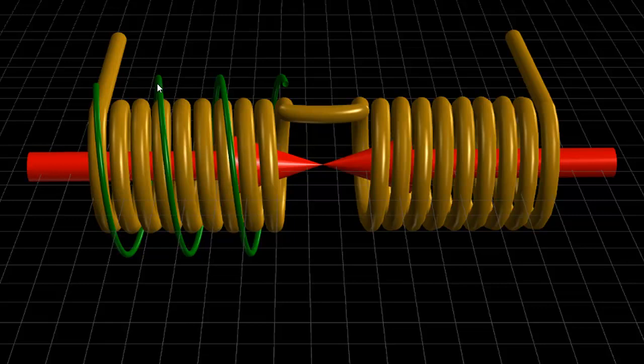It pushes the impedance up, so the input current to this coil goes down. You can have a coil with 20 turns of, say, 20 gauge wire, and have very, very little current. If you look at the cycle on the coil, you would see that a certain amount of current is being sent back to the source. Sometimes it can be surprising; you can have a lot of current sent back to the source in some situations.